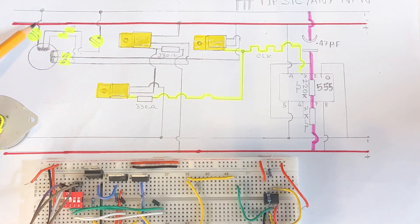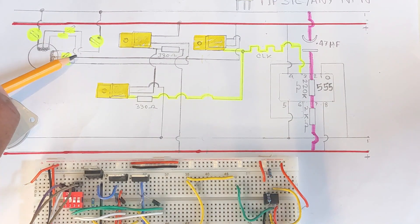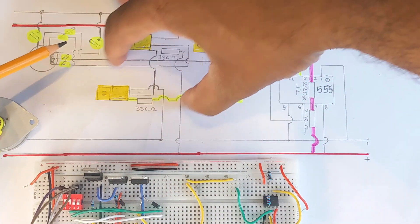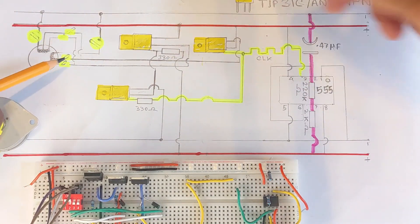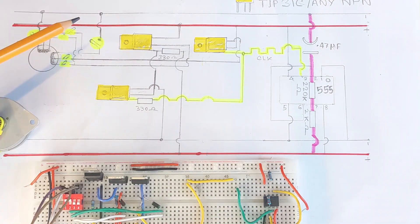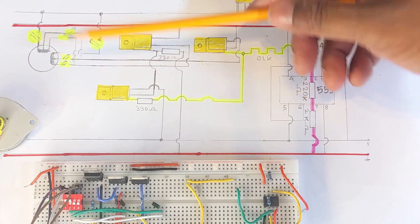The ground is connected in this configuration, and I put four switches to the two secondary coil cables. If I turn on these switches, this part of the circuit will get the 12 volt voltage to this coil. If I turn on the other one, it will get the voltage and the motor will move anti-clockwise. At any given time only one set of switches is allowed to be on, and the ground is always on.